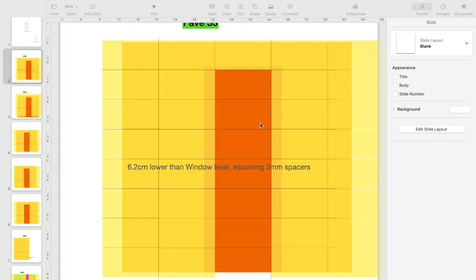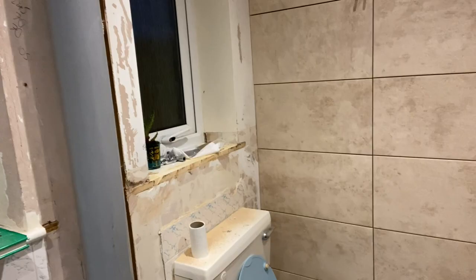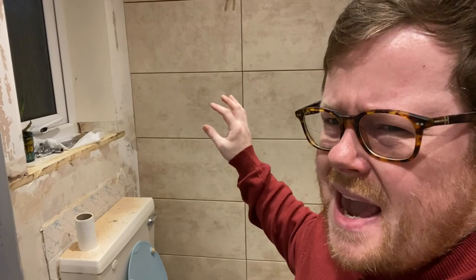For my very first bathroom tiling, I'm fairly happy with it. I followed proper methods - putting a level bar at the bottom so it's level all the way around the room. I planned the layout in a PowerPoint-type program to avoid having small tiles at the edges of walls and around the windows. I'm going for a sort of spa-type look. There's going to be a black radiator on that wall, which I've ordered and I'm picking up this Saturday. I've also bought a toilet. We're going to have beige grout - the beige will make it look like a more complete wall and hide slightly uneven grout lines.